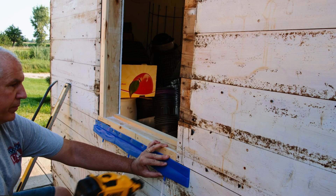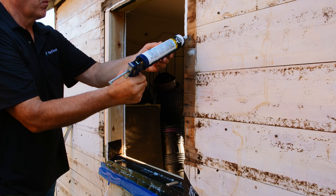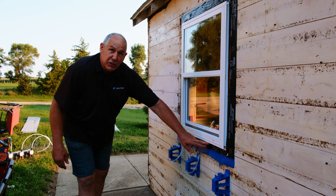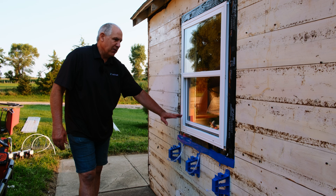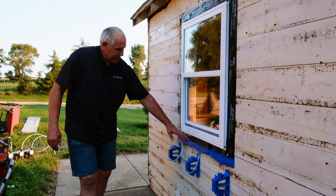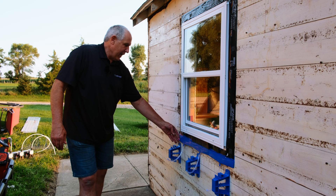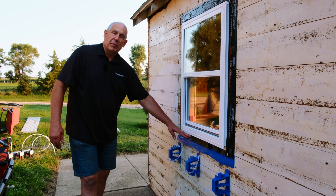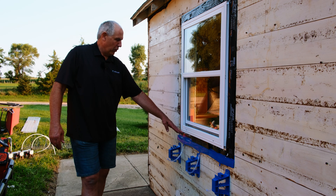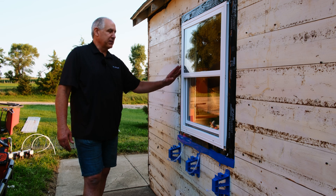When you go to put the window in, before you put the window in, you caulk the top and the two sides, but you do not caulk the bottom at all. In fact, you ideally want to leave this open or even put shims in the back of it so it can drain easily out. So when water gets in the silpan, it's going to drain out through there behind the flange and then into these window drains. Because this is all solid spray foam, if you didn't have any drainage, you'd just have water building up and piling up behind there. This gives it a free flow path out.